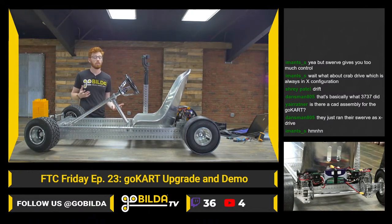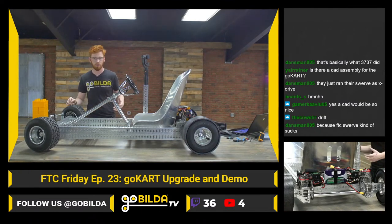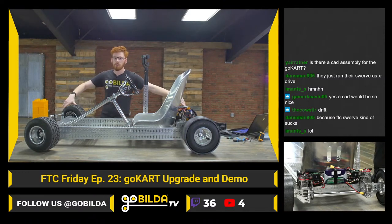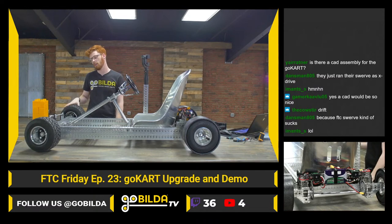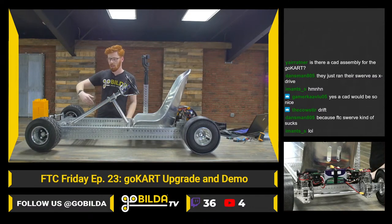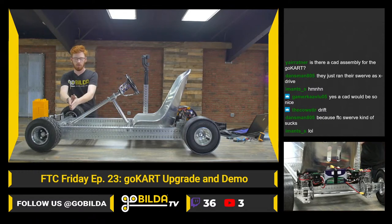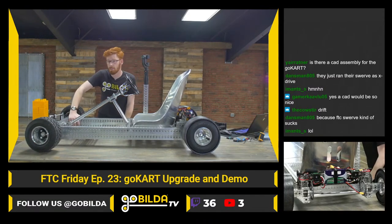Something that I've seen some people use more in competition robotics is a four-wheel drive with four independent motors and omni wheels that are all facing the same direction. That doesn't give you the ability to strafe like an X-Drive, where you've got your wheels at 45 degrees, but it lets you change the center of rotation of your chassis. So if you have four independent omni wheels, you can drive just the front two and push your center of rotation way further toward the front of your chassis, swing your back way around. For some scoring elements, that can help a lot.